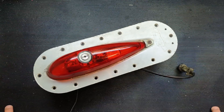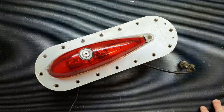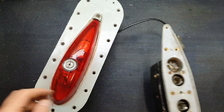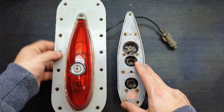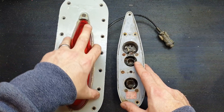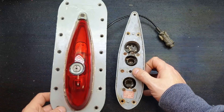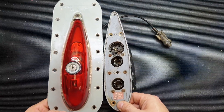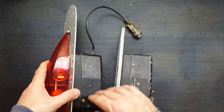Digging about on eBay, I found this. It was sold as an ex-Vulcan lamp off XL445. I've since discovered that cannot possibly be true because this is not the mounting plate on the Vulcan B2. How do I know that? Well, of course I've got a real Vulcan to compare it to. If I bring in one of the damaged lights off the Vulcan we're restoring, you can see the configuration of the lamp is completely different. This one is mounted on a three-millimeter aluminium plate with a teardrop shape embossed into it. This other one is a casting which has a lip on it, but as you can possibly see looking through the glass, it is to all intents and purposes the same thing.